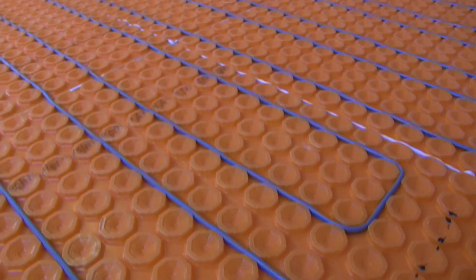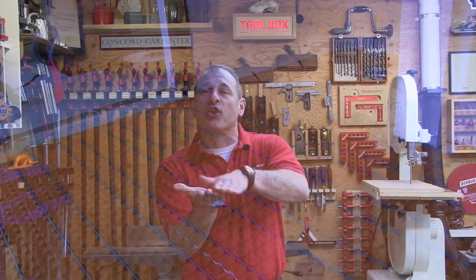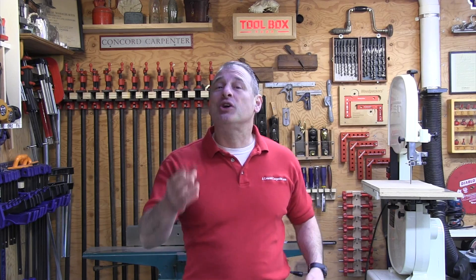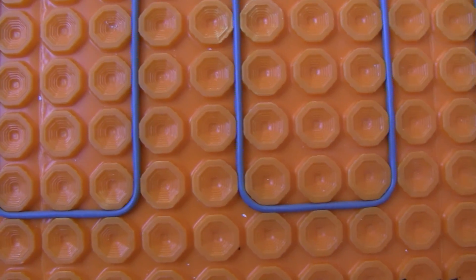In that particular application, I'd recommend you use the DITRA-HEAT DUO which has a thermal break in the floor and will help warm up the floor faster. Or you can use the two-three stud spacing to use up more cable, and I did that in this recent remodel.